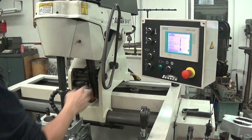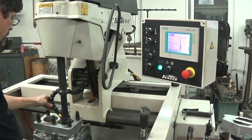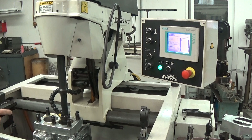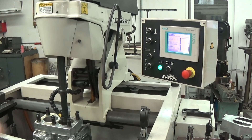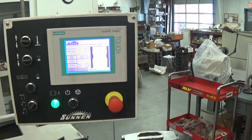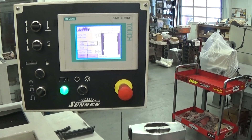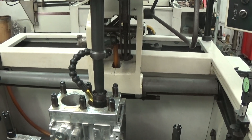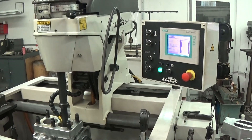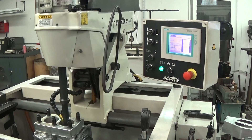I'm just dropping the hone in the cylinder — I don't need to squeeze a shoe. You can probably hear a little bit of runout. I can see it's tight at the top because of the deck plate, and the machine senses that; it'll stop and dwell there. It also shows you the profile of the stone as it's honing — where there's more blue is where it's tight. After a couple of strokes it was tight in the middle, so it stopped there. I'm just taking a couple thou out, dwelling at the top where it's tight, and I'm only over-stroking out the bottom of this cylinder.